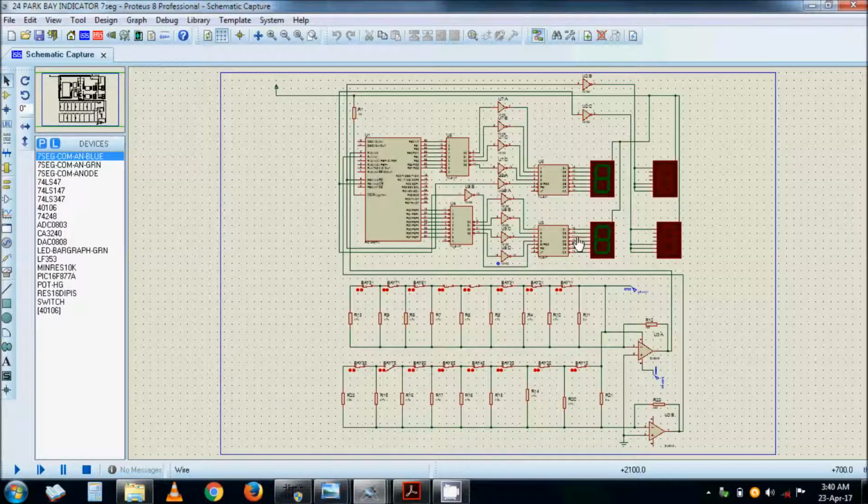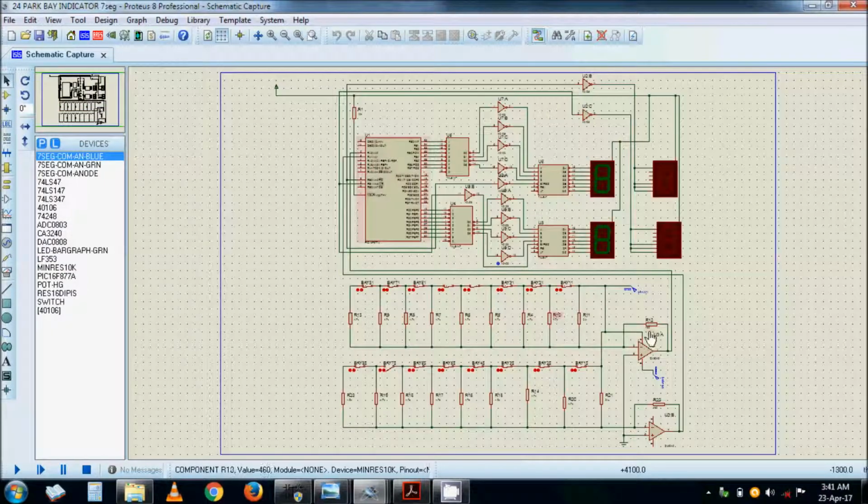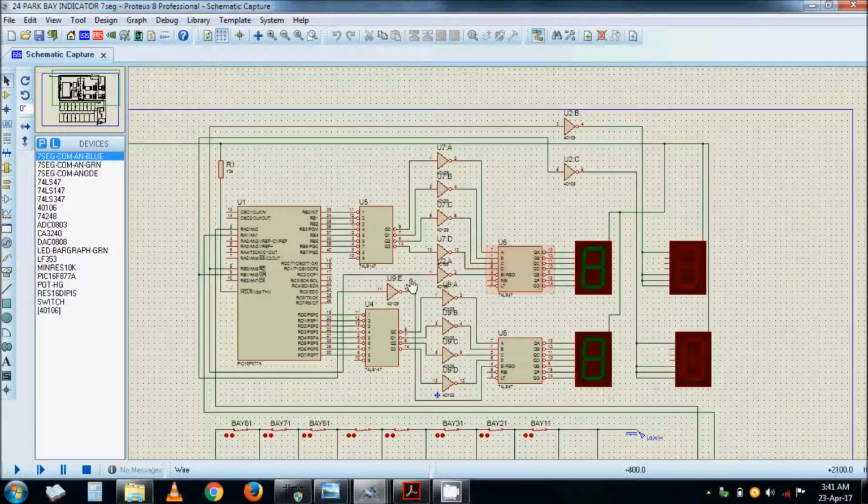simulation. This now is a 7-segment indication. So basically, for the 7 segment, this circuit is identical to the previous, but the only difference is now you have a decimal output here with an active low input converted to a binary coded decimal with an active low output. Then you must actually invert it, because this 7-segment driver has an active high input, so convert it from active low, it becomes active high here.